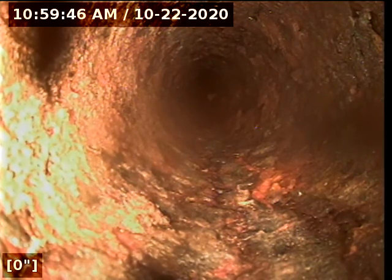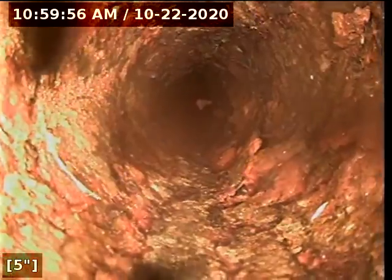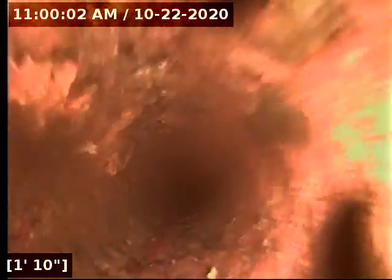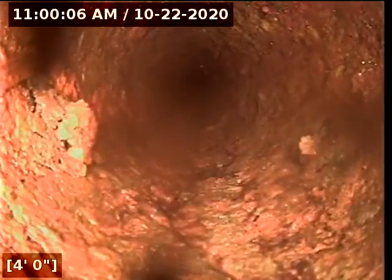This is a pre-purchase inspection in Tampa by the airport. We're at the base of this 2-inch stack on the left-hand side of the house. We are in this 2-inch line right now, and you can see that it is scaly. Often times these 2-inch lines, it's okay to be like this — it's very minimal scaling.